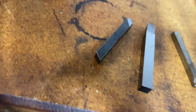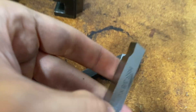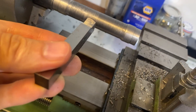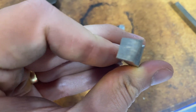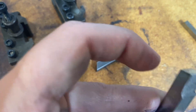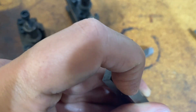The other thing to know about these high speed steel cutters is there are particular angles. This one right here — this is a three-eighths inch thick blank — you can see here how it's ground. So it goes in the tool post like that and it'll cut this way from right to left. There's something called rake angles and relief angles. The proper angle measurements are usually about 10 to 15 degrees — about 10 or 15 degrees from horizontal. You have to grind all the ends. This one right here is ground back, and this is the point right here that's actually making contact with the work. The idea is this point should be the one that's protruding and making contact, and not this inside piece right here.